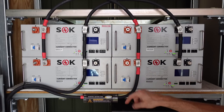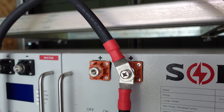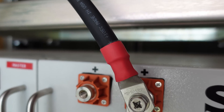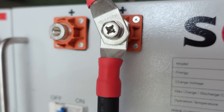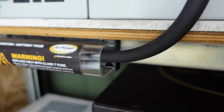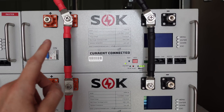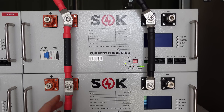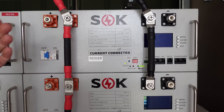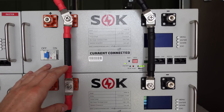I do envision the second shelf being the same once I get two more batteries. I did cut these top cables a little too long unfortunately. Here's a close-up of the terminations — I've got glue-filled heat shrink to ensure a moisture-tight seal around the crimp, properly color-coded into the Class-T fuse. One last thing to note on the rack batteries is I need to get some kind of terminal covers on these for safety, as the covers that came with them don't support the two-aught gauge cable. I don't have a 3D printer, but it definitely needs some sort of covering to prevent accidents.